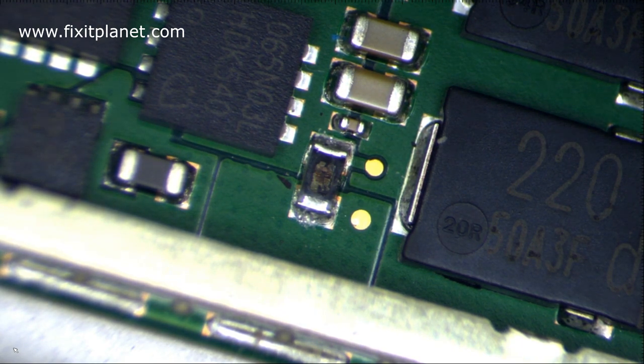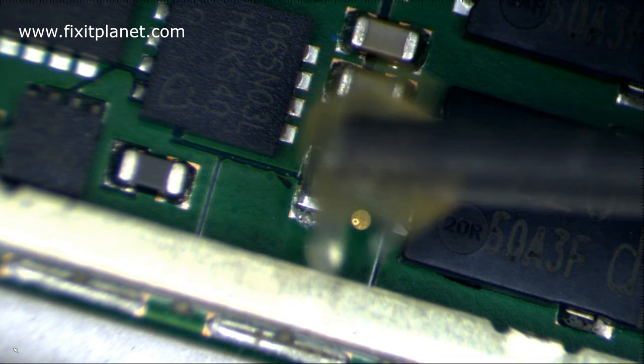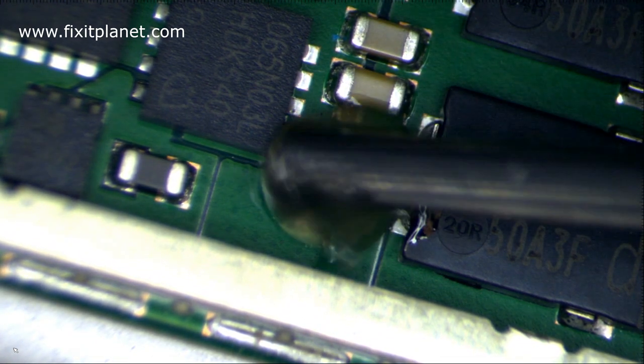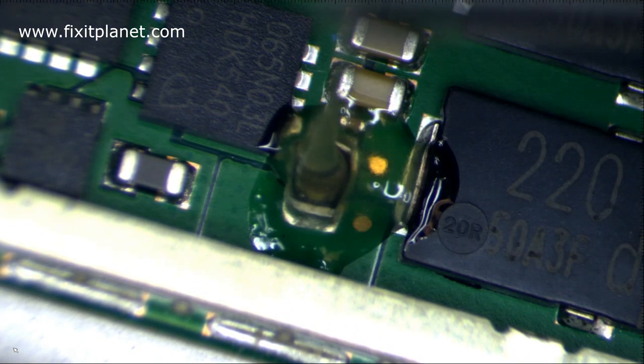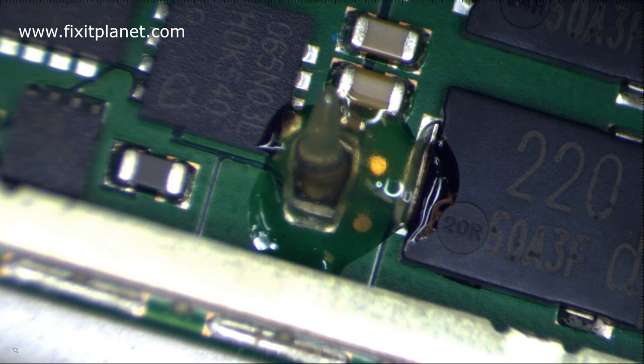If the system is actually running off of the AC adapter, but not when you disconnect that AC adapter, so therefore it does not run off the battery, there is another area where some diodes reside. I started to mention it and I got sidetracked, sorry. We're not really looking at that area at the moment, and I'll see if I can point it out later on, but that's not our problem on this particular tablet today.